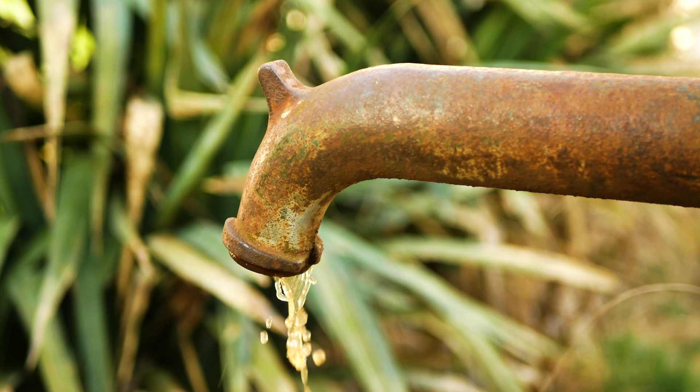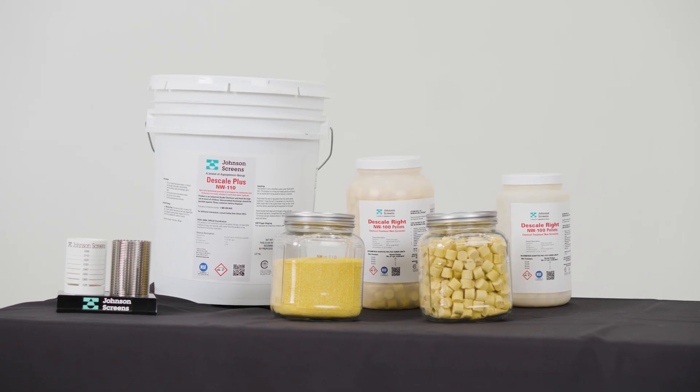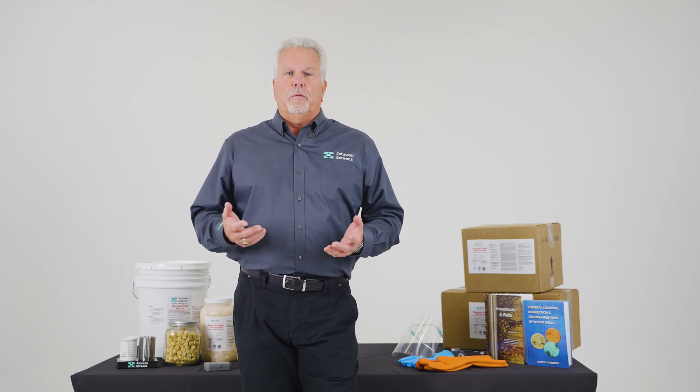You may be asking: how do I know if I need to acidize my well? The primary reason you would consider using acid to clean your well is diminished production. However, you would first want to verify that there are no mechanical problems with the pump or any known pump failure. Once you know the pump is okay, you can contact your distributor to purchase the New Well Chemicals. It's likely you'll need to use them to remove the calcium carbonate or other mineral scales that are built up in the well, which lead to the plugging of the screen at the bottom of the well.